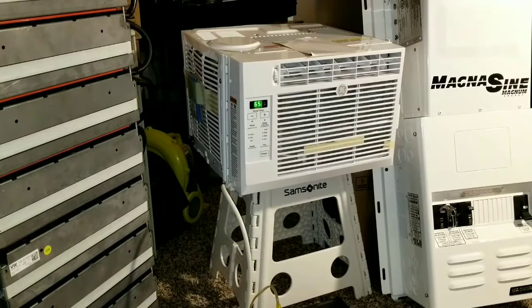This is how you run air conditioning on an off-grid solar system with battery backup using lithium-ion batteries — from a Chrysler Pacifica and Ford Focus. We're sitting at 79% state of charge, voltage at 63.7 volts, and currently cooling on just 1.5 amps from the batteries. Live in Minnesota at JW Solar USA — thanks for watching.